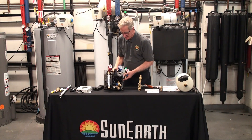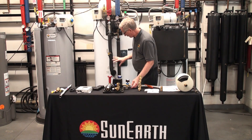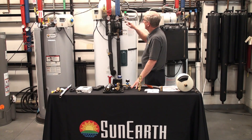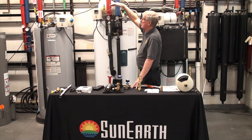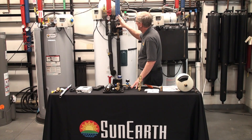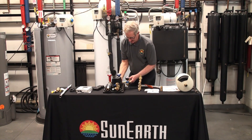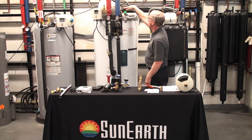This is all one unit — all complete. We mount it onto the tank and attach it to the two ports on the tank that are connected to the heat exchanger. And then these two pipes from here go up to the roof, so that's something the installer puts in once the tank is set. The other item connected to this pump station is the expansion tank, which connects through a tube here — from this little port on the main station to the expansion tank.